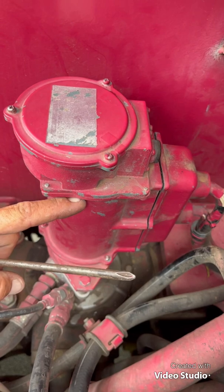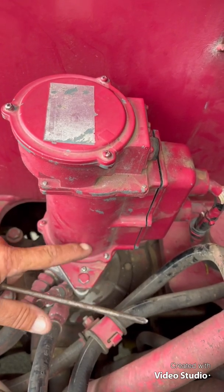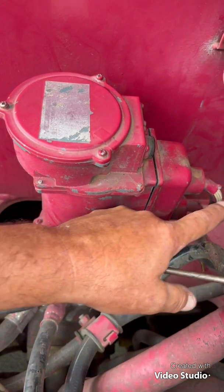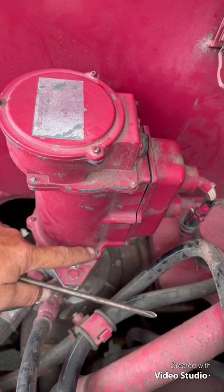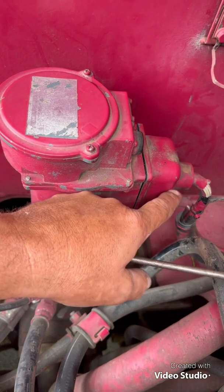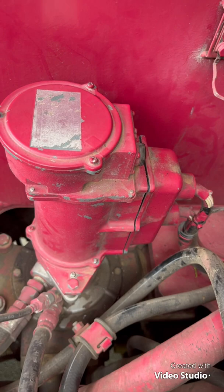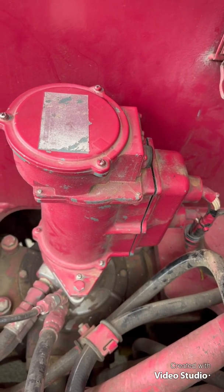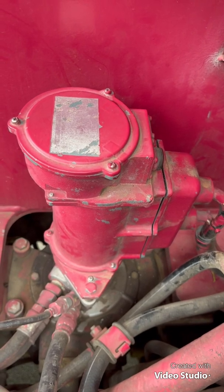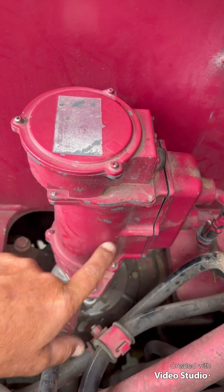There are two components of the rotary brush: the rings — the discs or contact cylinder — and the brushes. The rings come from the top, the discs from the bottom, and this stays stationary. The brushes spin with the whole superstructure, with the whole top of the crane. I'll bring you back once I have it open and get a closer look at what's going on, but I expect there's going to be crap, carbon, all stuck in between the discs.